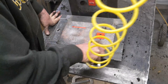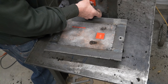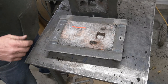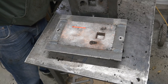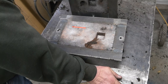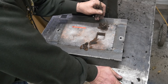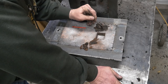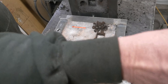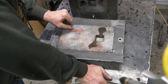Alright, that's good. Now the hard part — this one will be the easiest one. That's the A, I see the A. There's the bottom half we're going to cut. We're going to cut a runner with a gate. Why don't we cut a basin down here too? Then we're going to cut a gate into the end of the part. Now I'm going to go ahead and try to pull it from down here at the vent end.